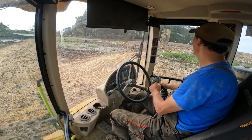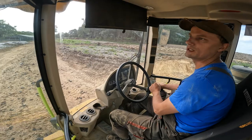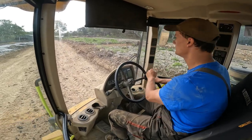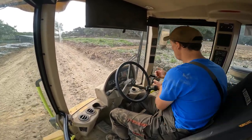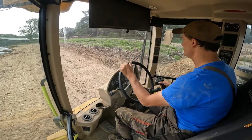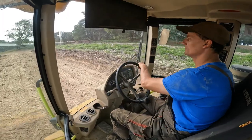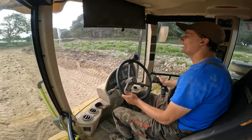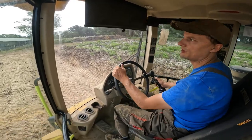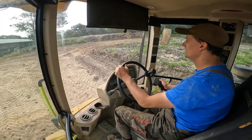One cool thing I really like is that everything is on that joystick here to control it. It's really nice and really confident - it takes some time to get used to all the buttons, but overall it's pretty good. There are four-wheel drive, backwards, neutral, plus and minus for the manual gear, and you've got a diff lock and a handbrake. So when you're tipping, you just press the button - you don't have to press the brakes - and it keeps the machine steady while you're tipping. Then you just hit forward or reverse and it releases and goes straight away.